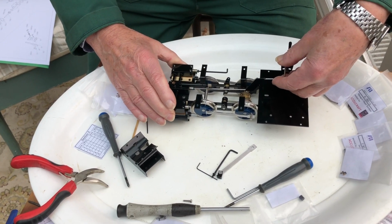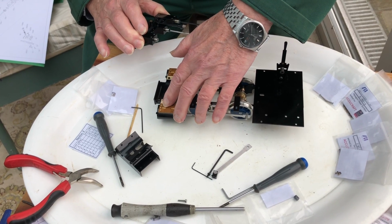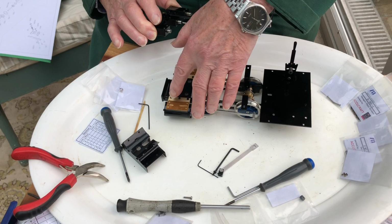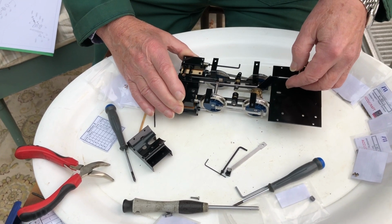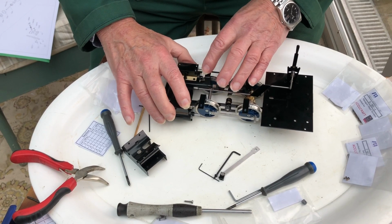So this valve set goes right on the top, but before we do that, just make sure you have these gaskets the right way around. The steam ways are different lengths in the gaskets, so make sure they're actually the right way round. And then the top goes on with the countersunk stainless screws.